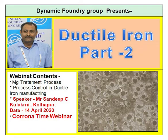Check bath sulfur properly. Many times we focus on carbon, silicon, manganese and copper. We are a little bit not focusing more on these elements, phosphorus and sulfur. So very carefully you have to see sulfur in ductile iron, because it can be a very important element, because based on your bath sulfur you have to decide your magnesium addition. So give focus on this element, particularly sulfur.